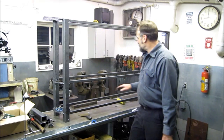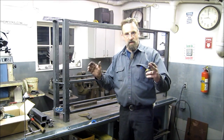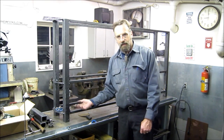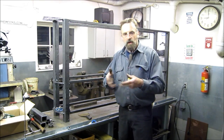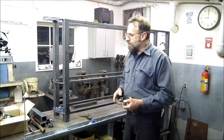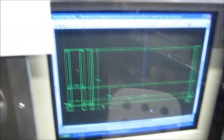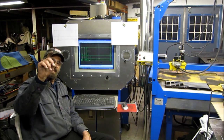It is pretty nice having a nice cast iron table here, and with all the box tubes exactly milled to their lengths it's very comfortable and easy to put together. I put the threaded inserts in the bottom — those three-eighths tapped holes are basically going to support the closure that's going to be on the overhead ceiling when the TV is fully retracted, to close up the opening, and that's how those will mount. They also came in handy to really hold these square and level in line as I go along. I am drawing this up and we're getting some pretty nice drawings. I'm going to call it a day and get her done.